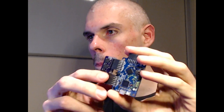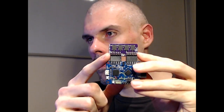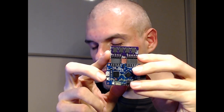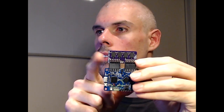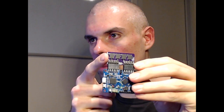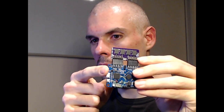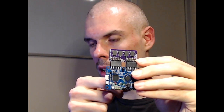Most people should be familiar with it, and what I have wired up to it is the quad hyperRAM PMOD. I wrote a hyperRAM controller for this. What I want to do is basically use that memory and make it accessible to the PicoRV that will be running in the iCE40.